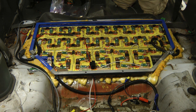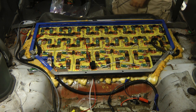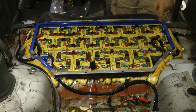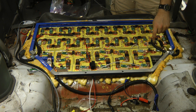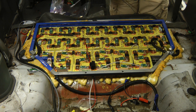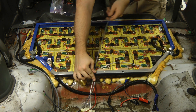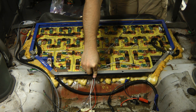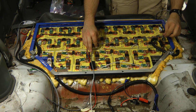Now that all the cell boards are installed, it's time to install the BMS controller. To start, we need to cut some wire to make wiring harnesses. Basically, one wire to each bank goes from the controller — which will be probably around here somewhere — to one cell board. Then another wire runs off to the other cell board at the other end of the bank. So we'll start putting the wire to where the controller will be, a little bit extra, then figure out how we're going to route this.